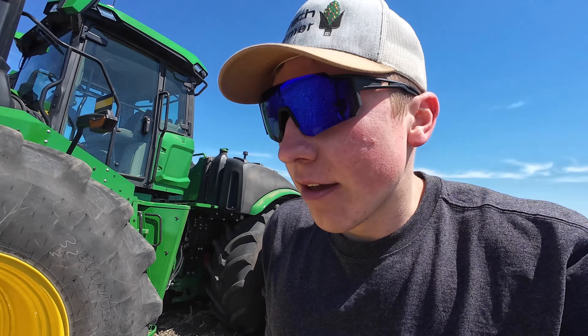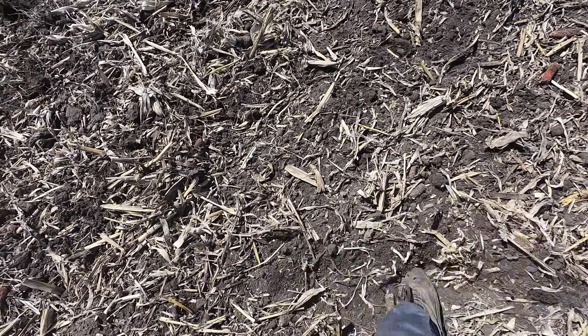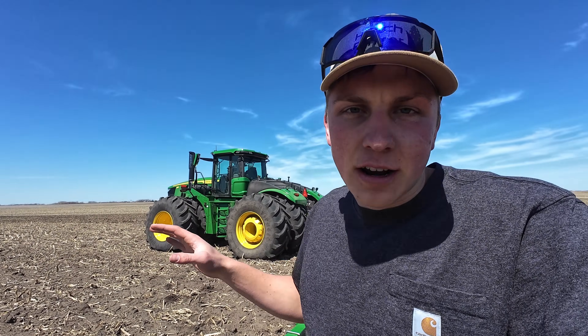I went a whole round at the 3.5-inch depth. Figured we better jump out and see what kind of job it's doing. Looks like I'm hitting the perfect 3.5-inch depth with the digger and tractor. The main thing is I just want to make sure I'm working up the tractor tire tracks with the implement — that way I'm not creating any compaction or hurting yield before we even put any seed out here. We just want to make sure we get deep enough that there isn't any compaction layer underneath.